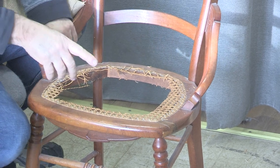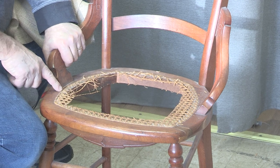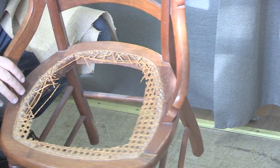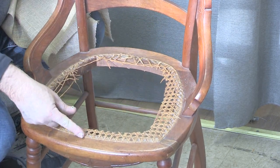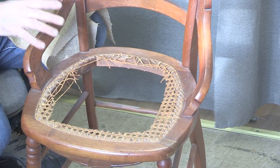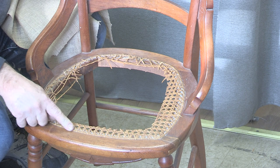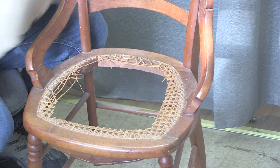What I'm not going to do is go inside here to try to remove the entire piece of caning, because I don't want to create any more damage to the wood. The client has expressed interest in really minimizing how far out the upholstery is going to come. We're going to upholster this from the top — not the whole thing. She wants to save as much of the wood showing as possible, so I want to keep this on. I'll probably use some of this to staple my webbing.